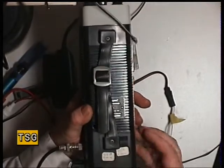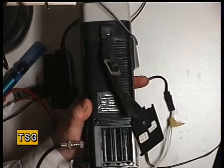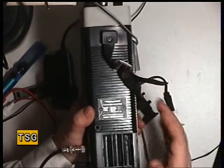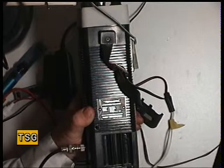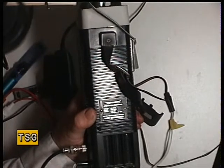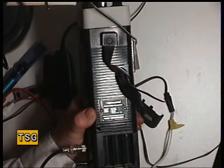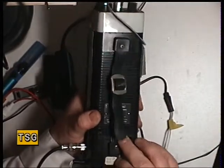These are 30 years old. If we remove the battery cover, you put 10 rechargeable batteries in this — 10 times 1.2 volts equals 12 volts. Or you put 8 normal throwaway batteries in: 8 times 1.5 volts also equals 12 volts, in which case you put 2 dummy batteries which these were originally supplied with but are readily available — for example, Maplins do those.